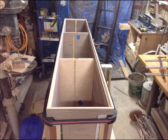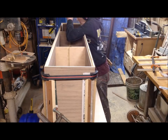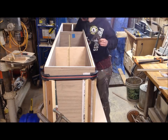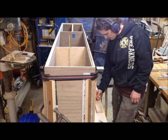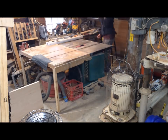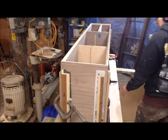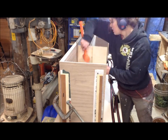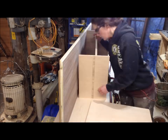I finally have all the internal dados cut, and now I could measure all my openings and cut my pieces. I cannot stress how much being able to take this cabinet apart and keep it square made this process so much easier. I started with the one on the end to separate the two drawers — you don't technically need it, but the cabinet is so large I wanted that piece there so it couldn't rack over time. Then I measured and cut the ones for the TV components. All my dados were lining up and all the depths were the same, which is a good sign when your pieces aren't connected yet.